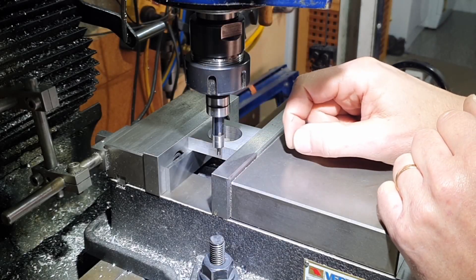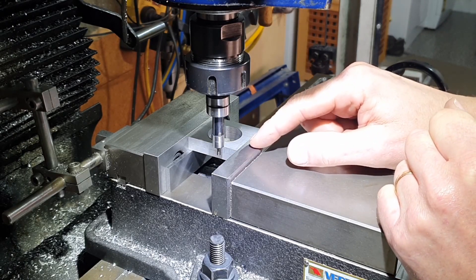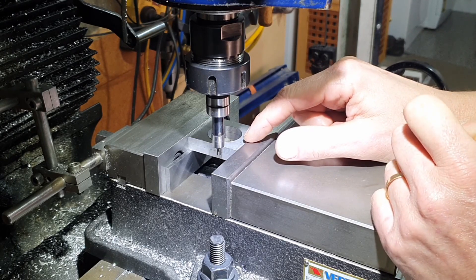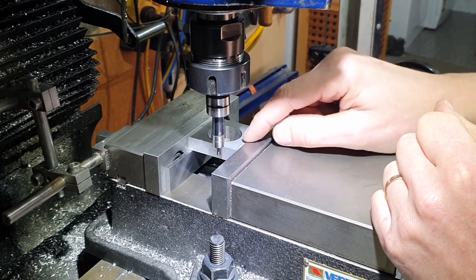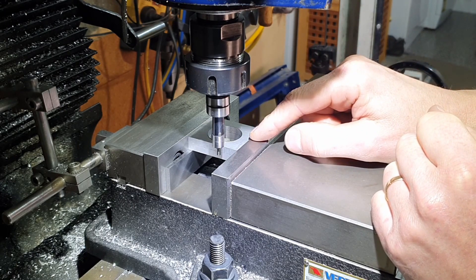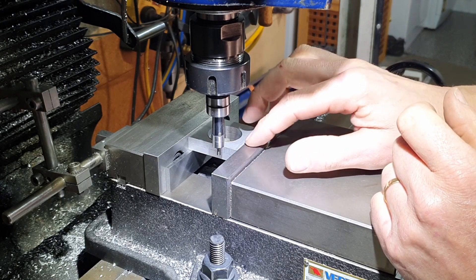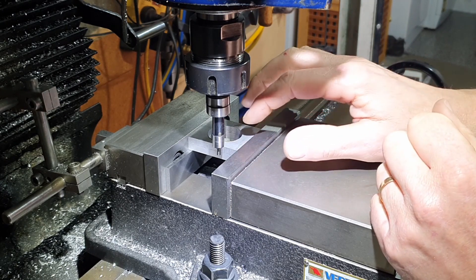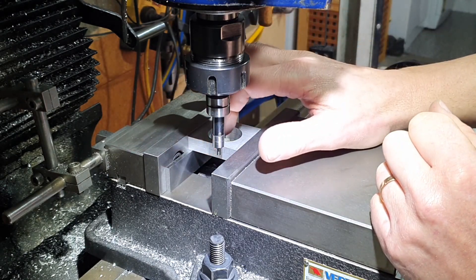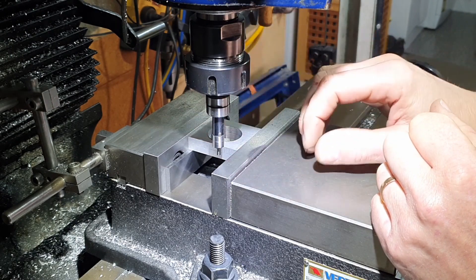The Hoglet plans are all in imperial and the nuts, bolts, and threads to cut are all in UNC, but I'm going to change some of those over to metric simply because I've got metric nuts and bolts in stock. On the cylinder crankcase tops here we're going to be drilling eight holes - four of those are going to be through holes and the other four are going to be threaded M3. We're going to work from the bottom, which is our datum line, get to the center of the circle, and then the eight holes are worked off from the center of the circle.